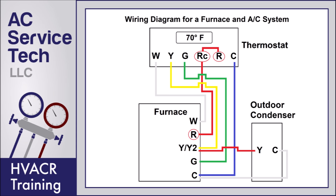Now we're going to go over the voltage path for turning on the fan, cooling, and heat. With the thermostat powered at 24 volts and C wired back to the furnace, when we turn the fan on, R connects to G inside the thermostat. That signal goes back to the furnace control board and energizes 24 volts on the G terminal, which tells the furnace control board to turn the blower on.